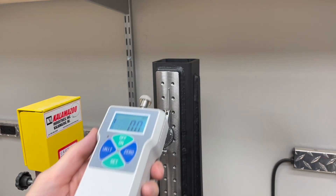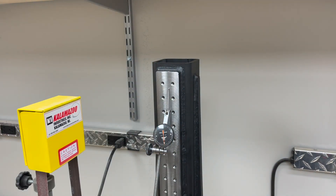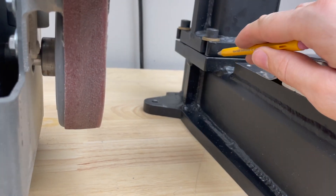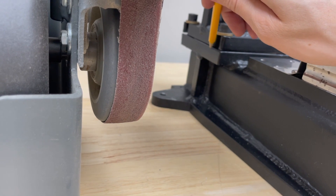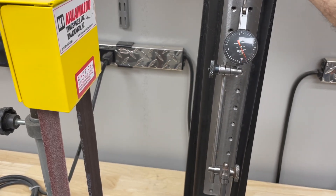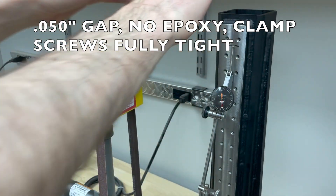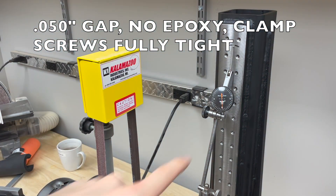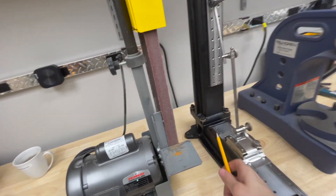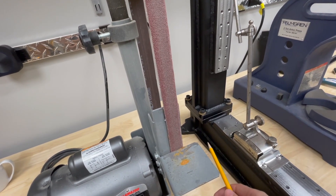I do have a force gauge; my original plan was to push with it, but I'll slip right off so it's probably good enough without. I'll mark where the indicator tip was in case it moves. Now my setup has a gap of about 50 thousandths of an inch — the column is resting on the set screws with the clamp screws really tight. Pushing as hard as I can, it moved to four and four and a half thousandths — about five and a half thousandths total. This is definitely weaker than before. The question is: when I fill this with epoxy, will it go back to where I was, be even worse, or somewhere in between?